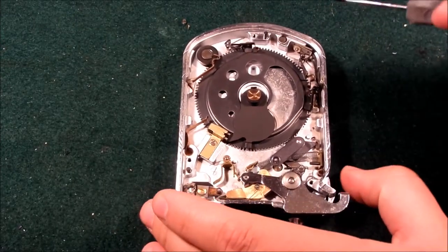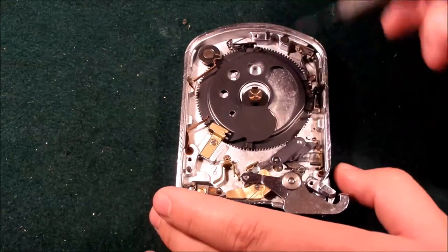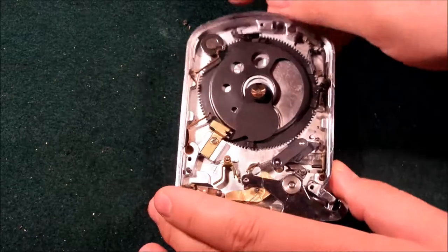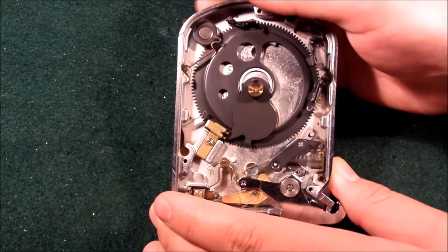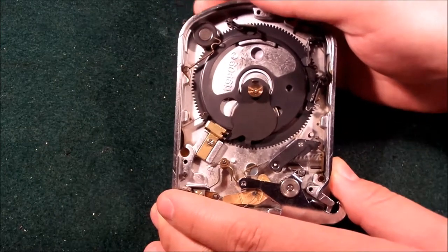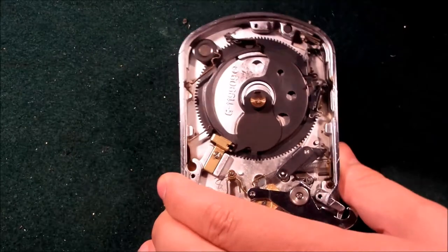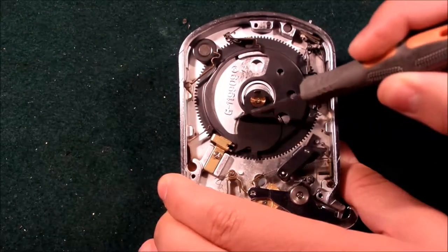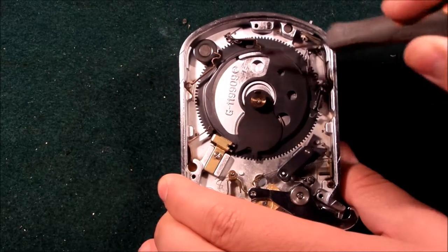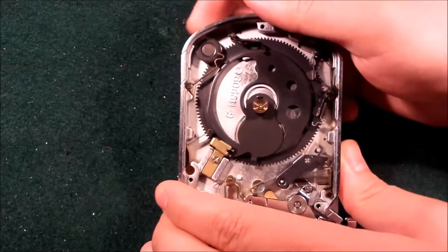What you're going to see is there is a large drum, and that's geared to the EV control wheel. By rotating the EV control wheel, you're going to notice that it's rotating between these stops, up to the largest stop, which is simply a cutout in the wheel, allowing the lens to be used at its full aperture.